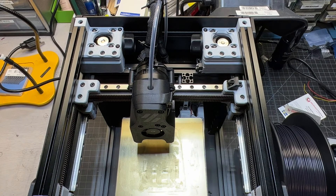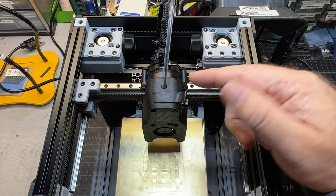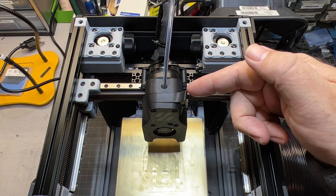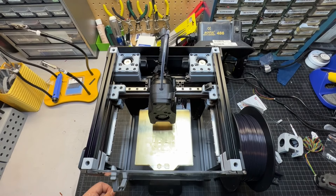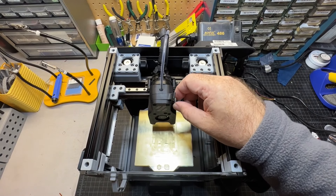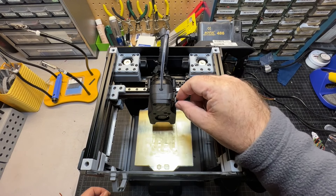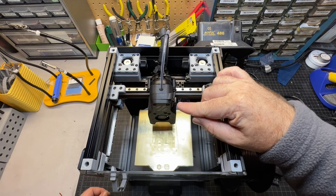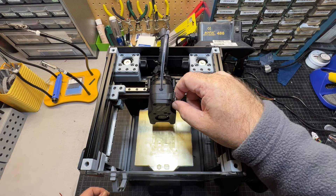But if you follow my channel at all, you'll see that you can do a lot with this particular extruder. You can even print flexibles, and it does a really good job printing flexibles, although you have to go fairly slow. Another challenge with the mini afterburner is — especially if you have an LDO kit — the spring they give you and the length of the screw are just not a great fit. I ended up swapping the springs out with an original Bontech spring, and that seemed to fix my issues.